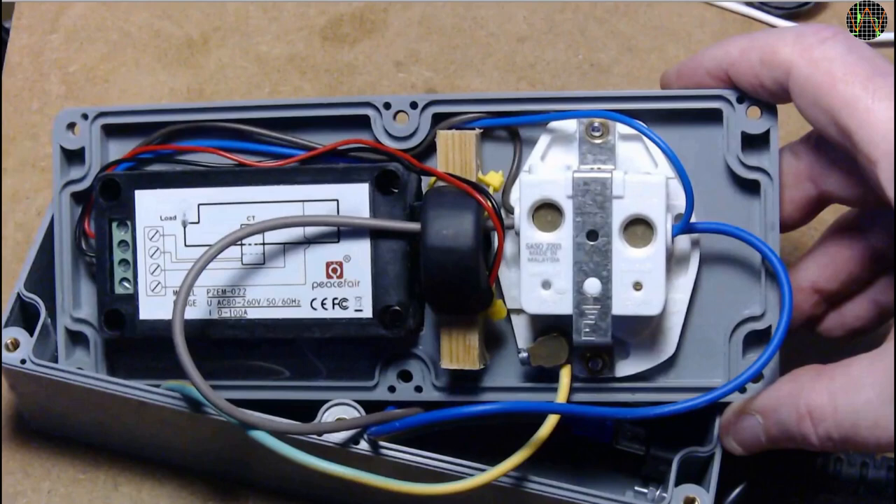Here is a still from the build of the original power meter. If you have not seen that video, you may want to use the link on the screen now. In the original wiring, I tapped the live power for the module — which is the thin brown wire — from the white outlet socket on the front panel because it was conveniently located. The problem is that the current drawn by the module flows from the inlet at the bottom through the thick brown live wire, through the core, to the outlet, and then to the module. So the module's own consumption was always included in the measurement.